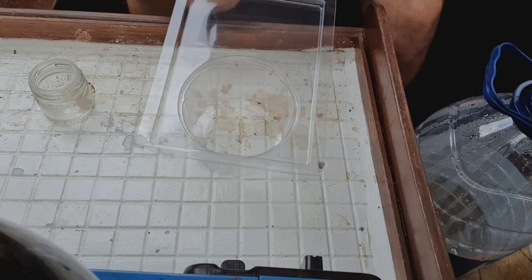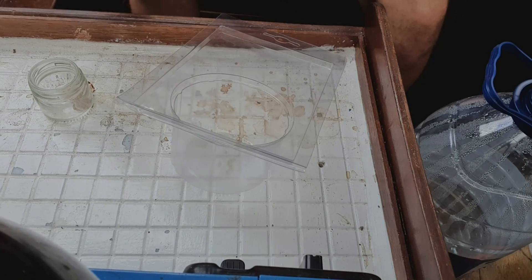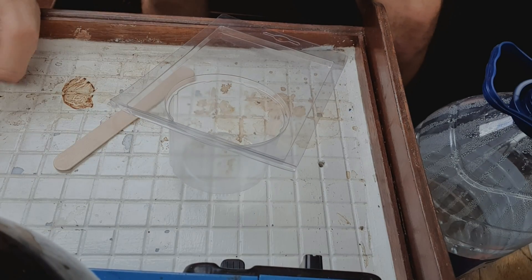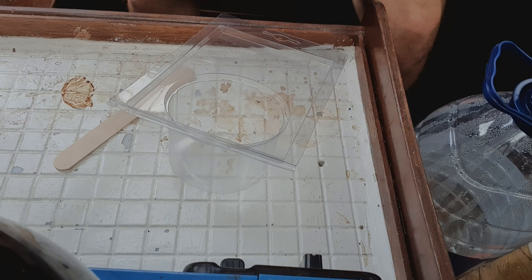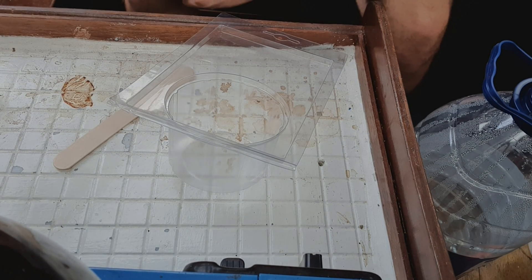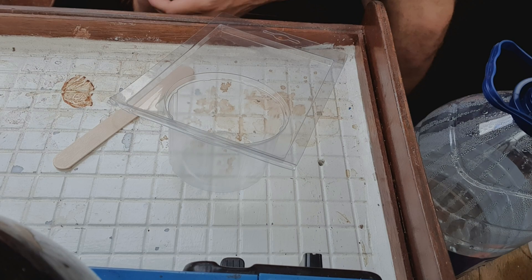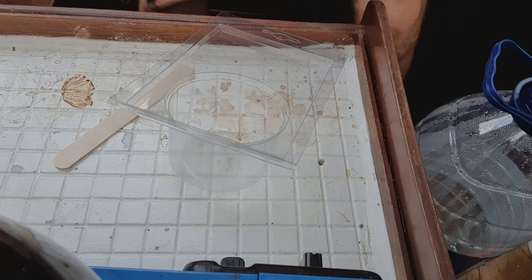This is the part I'll be mixing in. I'm going to mix it with just a wooden lollipop stick. It's a ratio of 5 to 1 — for every 5 parts of resin it's 1 part of hardener. I don't have the pumps that you can buy; they would cost me another £15 and I just can't pay that. So I'm just going to try and fluke it by filling up this little jam jar to measure out what I'm doing.